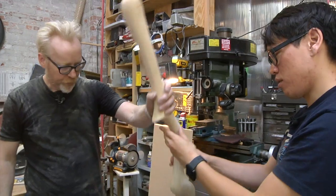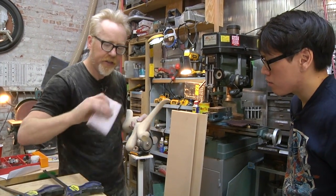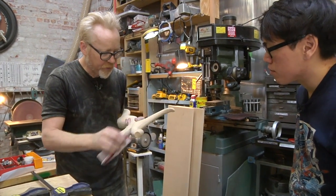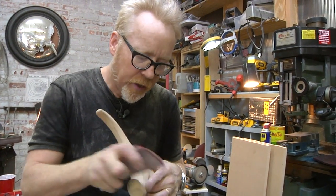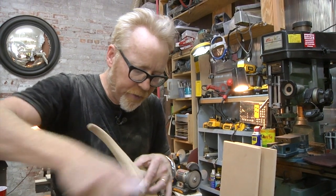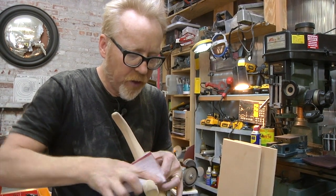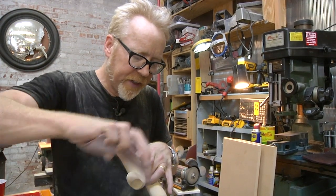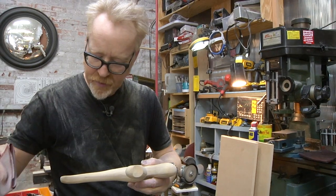What I'm going to do is give this a hefty coat of lacquer primer, which has a high particulate content, and that will act as a kind of sealer to seal the pores of the fiberboard and allow me to clear coat it and get a gloss finish. Because right now, this stuff acts like a sponge on paint. If you were to give it a coat of glossy paint, it would come out super uneven. You have to seal it before you get that paint.